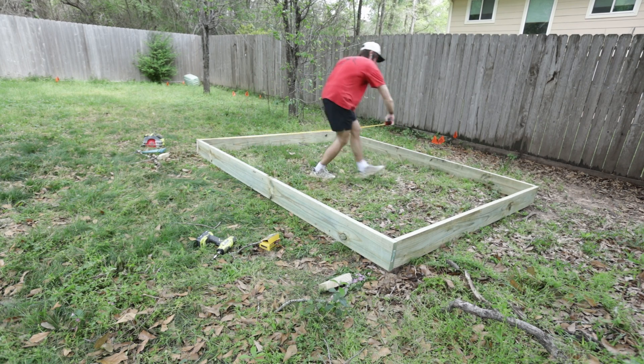Now we're going on to the sliding door and the window, and it definitely helps to have someone for this part who has some muscles — like my wife does. We get those in, and then you need the real muscles for the Hardy siding. This Hardy siding is no joke — super heavy, be careful with it. I use a couple nails on the bottom of it to hold it in place, then get my nail gun to nail it in. We got our electrical going up, the siding getting done, waterproofing happening, and our trim going on.